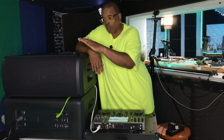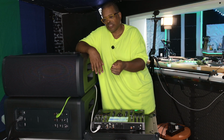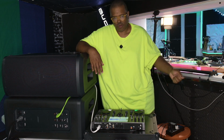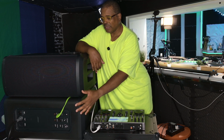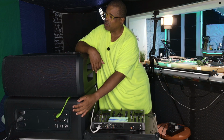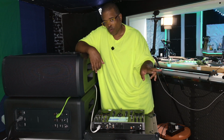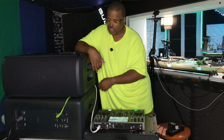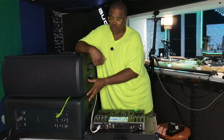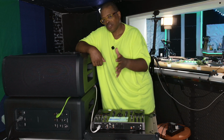So like if I had 4 sub 2s, I can't plug 1 sub 2 in with power and then daisy chain sub match cables from 1, 2, 3, and 4. It doesn't work that way. They say you can only use 1 sub match cable per pair. So I would need 2 to power 4 subs and plug 2 subs in with their power cord. So it would be every other sub would basically get power. So 1 set, 1 cable, 2 sets, 2 cables.